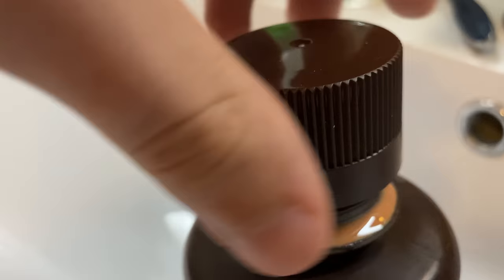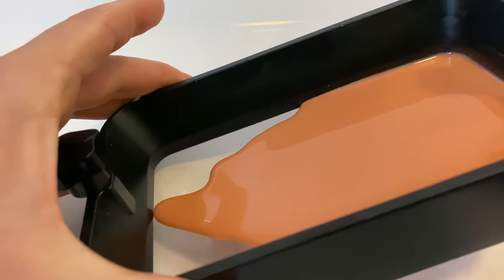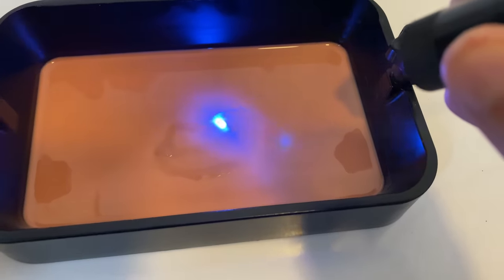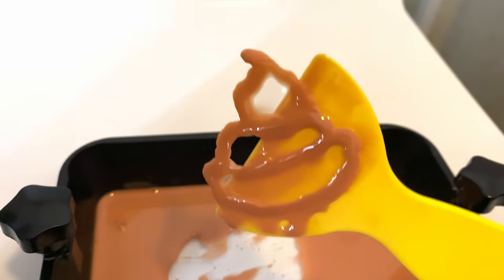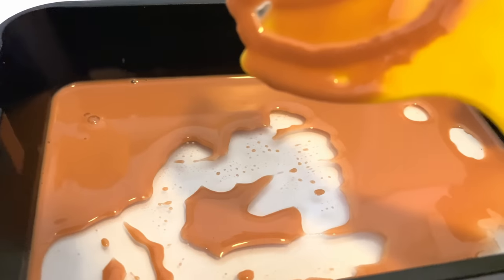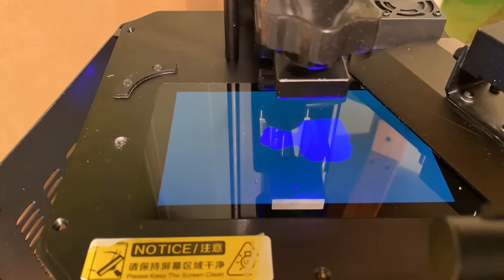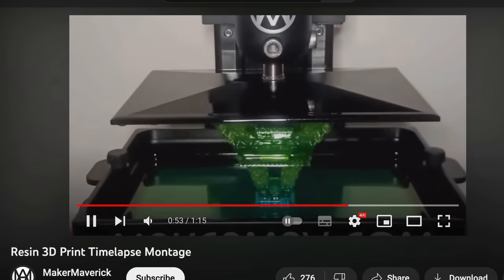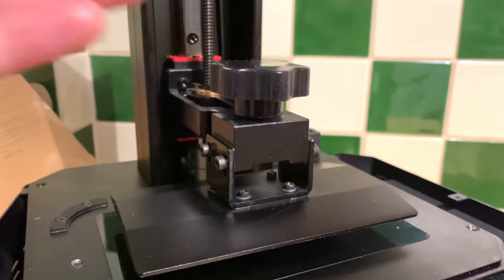I do want to give a brief explanation as to how resin printing works, because it's actually not very intuitive. I'm new to it myself, and I may well make mistakes. So in a resin printer, the resin is hardened or cured using UV light. To demonstrate this, I have an obscenely powerful UV laser, and I'm going to show you what it does to the resin. I'm just going over the surface of the resin with the laser here, trying to keep my hands steady. This is an artistic interpretation of the quality of my prints so far. Ordinarily, the container from the last video is placed on this screen, which produces UV light and is able to expose the resin from beneath. That resin then sticks to a top plate that lifts up, lowers down again, exposing the next layer, and layer by layer the object is built up.